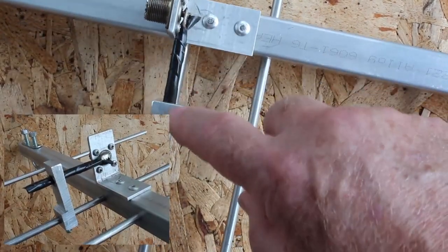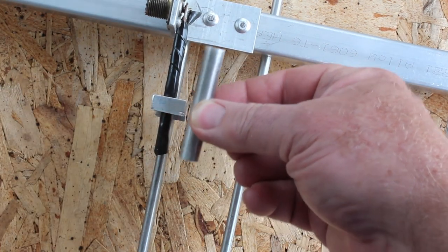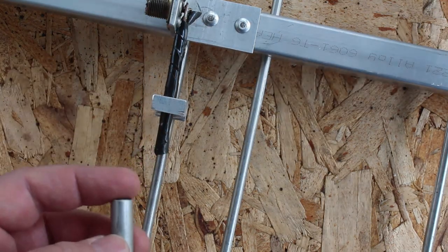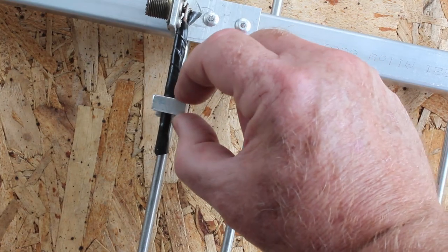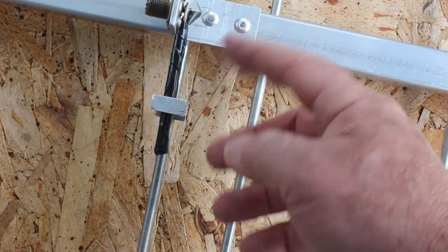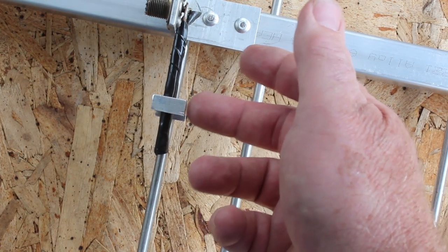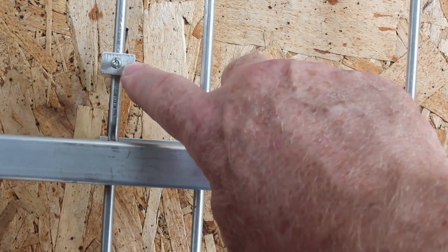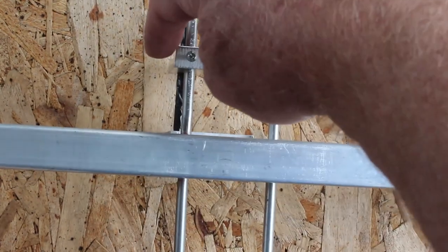I'll give you a better view of the matching element here. When I first started out, I was putting a large pipe in this hole over here, and I couldn't get it tuned high enough — it would only go to about 412 MHz. So I put in a piece of smaller pipe, then an even smaller piece of pipe, and eventually I got rid of all the pipe altogether. I ended up having to cut part of this off, because this amount of capacitance — just with this little bar right here around the insulated part — was more than enough to make the whole thing match at 433 MHz. That took quite a while to figure out; there was still too much capacitance, so I had to chop this bar down a little bit thinner. The reason I used a bar this size was so I could get screws in and also slide it back and forth to get the thing in tune, but even that width was still too much capacitance.